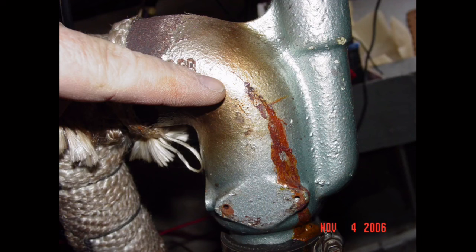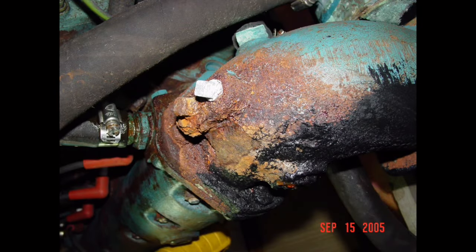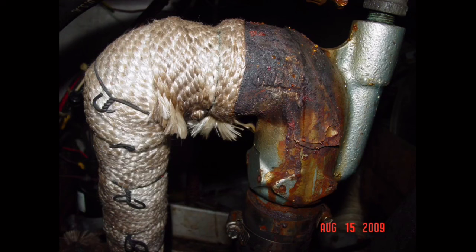When I was a kid, there was a TV commercial for an oil change franchise that featured a chimpanzee changing people's oil, and the big tagline was 'pay me now or pay me later,' indicating that if you didn't pay him now to change the oil, you'd be paying that monkey to change your engine out later on. Looking at this engine exhaust riser, we can tell that it's later. The running rust here is indicative of corrosion, and if it's this bad on the outside, you can imagine it is ten times worse on the inside. Exhaust risers, also known as exhaust elbows, should be periodically removed, pressure tested, and checked for internal corrosion or clogging, as failure here could easily result in catastrophic engine failure as a result of water leaking back down into the engine cylinders.